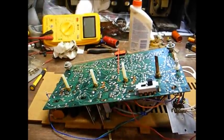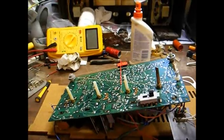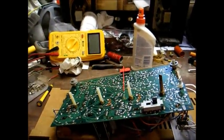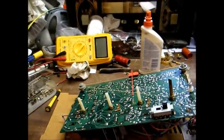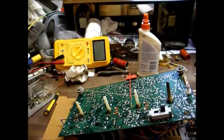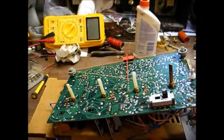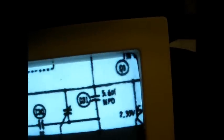Back on the GE radio — the biggest problem we're now faced with is the calibration of the FM dial, which is way off. When that happens, that's usually something in the FM oscillator circuit. Let's take a look at the schematic diagram. Here's our FM oscillator circuit, which consists of a transistor and some resistors and capacitors, and then we have the oscillator coil.